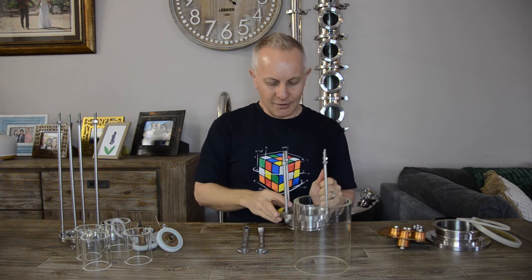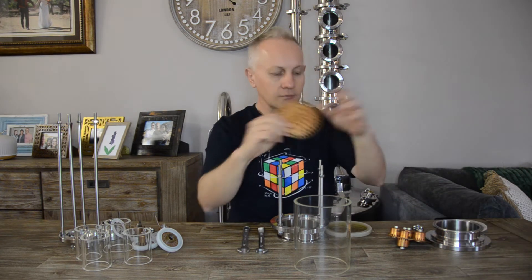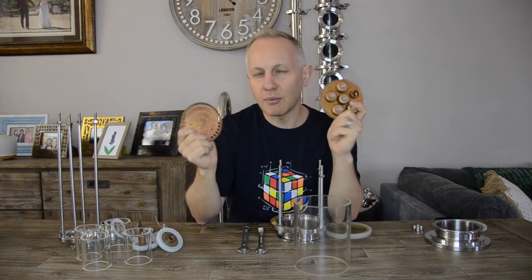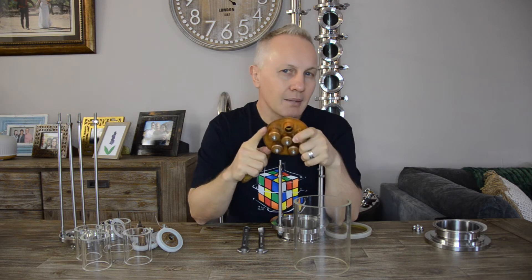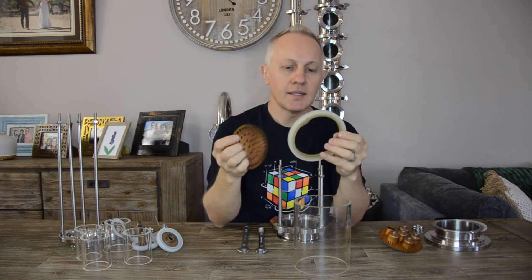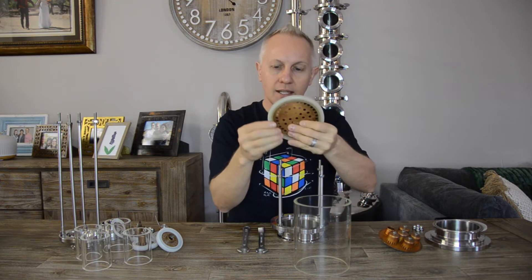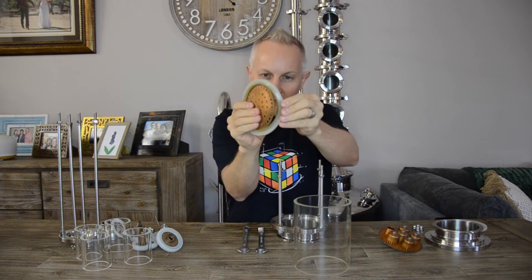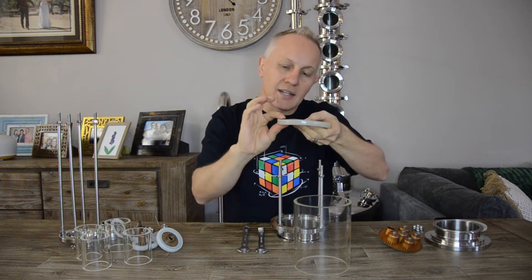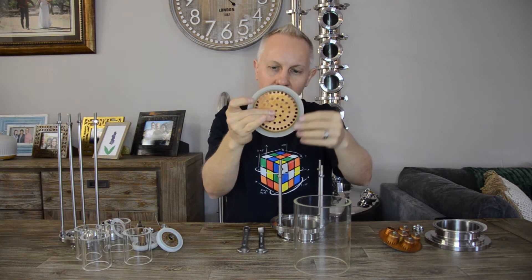First up is the four-inch. The four-inch is very versatile — I also use it with the 100-litre still, either with the perforated plate for ginning or the four-inch bubble tray. If you want to know more about bubble trays, go check out that video card. When you insert it into your seal, make sure it is inside and not sticking out where it can cause a pinch point or squeeze and damage the seal itself.